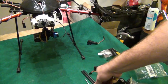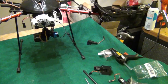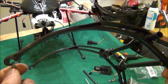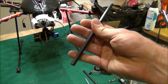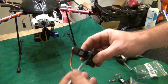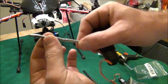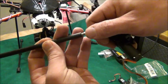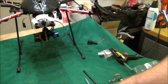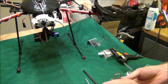First thing I did: these tubes have about a six millimeter opening. They're just the bottom struts off this cheap quad landing gear — you can find them on eBay. They're six millimeter inside, eight millimeter outside tubes. I cut them in half for the vertical struts. What I want to do is get the five millimeter wire — these aren't perfectly straight since they've been used — but that's okay as long as they're straight overall, because it's going to take up some of the width in the tube and fit in there nice and tight. We're going to hot glue that in, so I'm putting it into the retract.